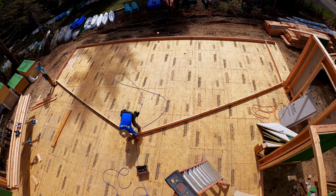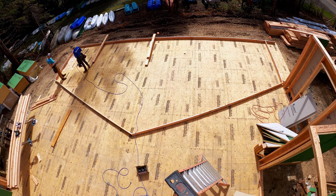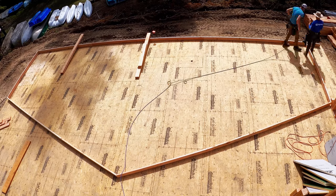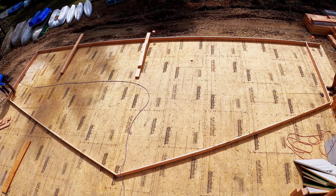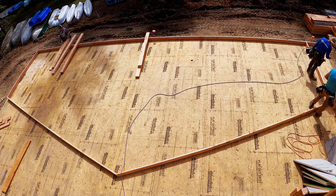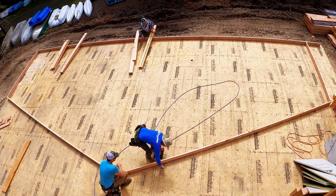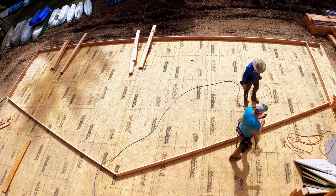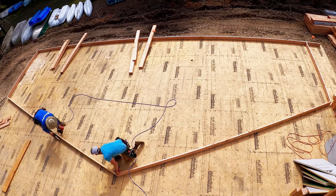Now Kyle and Shane can essentially snap out the wall because they're longer than our plate material. Nice straight line. They tack that to the wall, nice and straight. I mean, think about that. Our trusses aren't perfect, our rafters aren't perfect, but we can make the top plates of this wall basically perfect, or perfect-er. Let's make that the new term. They're perfect-er than the rafters that we would have used instead of the wall because they're framed to the snap line.